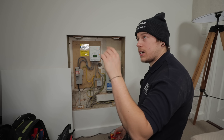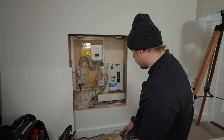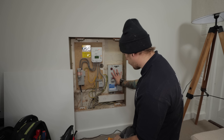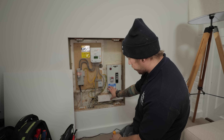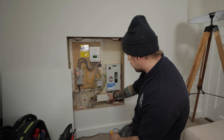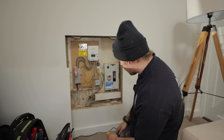While Luke's accessing the route through to the loft for the cable, I'm going to make a start on the electrical side. I'll turn all the power off, remove this enclosure and the trunking as well. There's a galvanized box there with the armored cable into it, and then we'll come up and go into our fuse board with the tails out and into the meter.